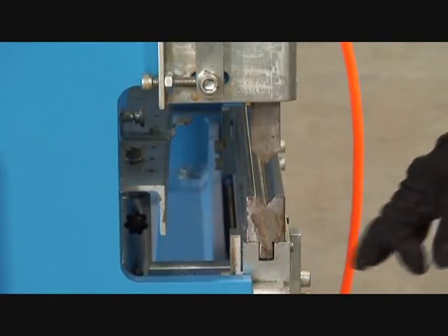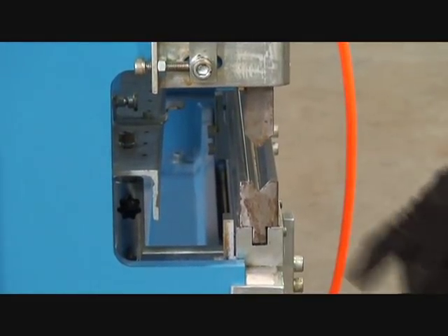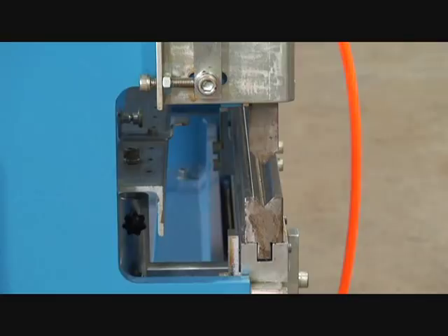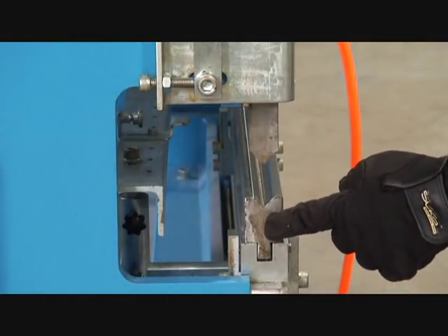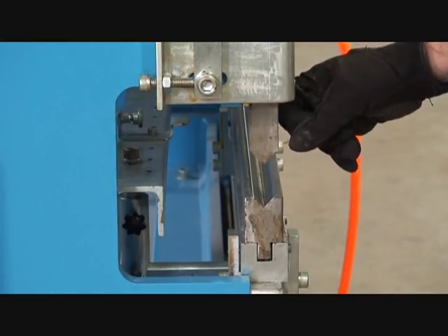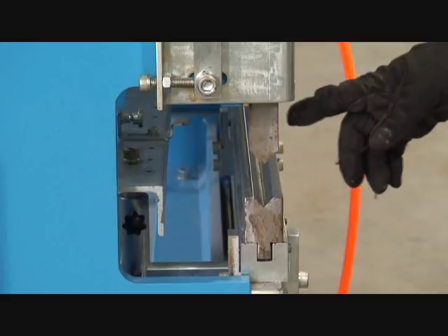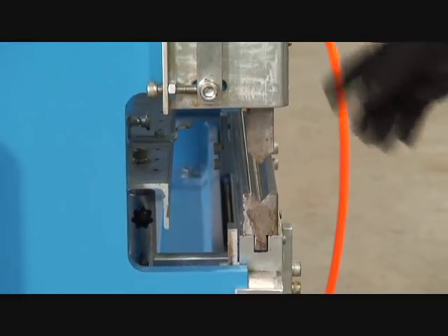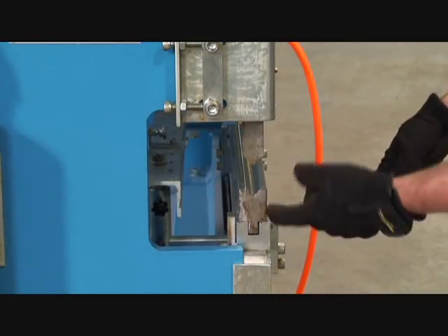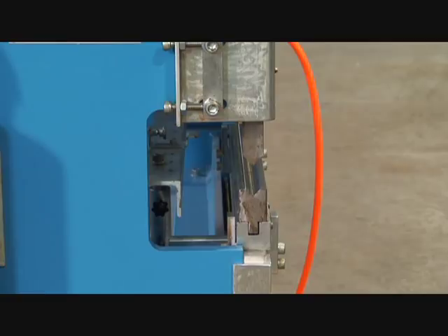All the air brakes come with a bottom die with a half-inch groove die holder. It has adjustable locks for your V-die when it sits into the half-inch groove. They also come with a three-quarter inch V-die as a standard accessory and a standard American style 89-degree punch. You can use the safety tang — just standard American tooling will work. You do not have to use any special tooling. We have optional tooling available, including a four-way die, a multi-way die, or any tooling setup you want.